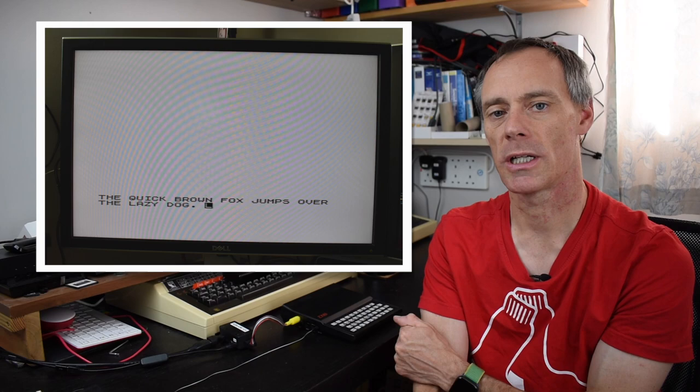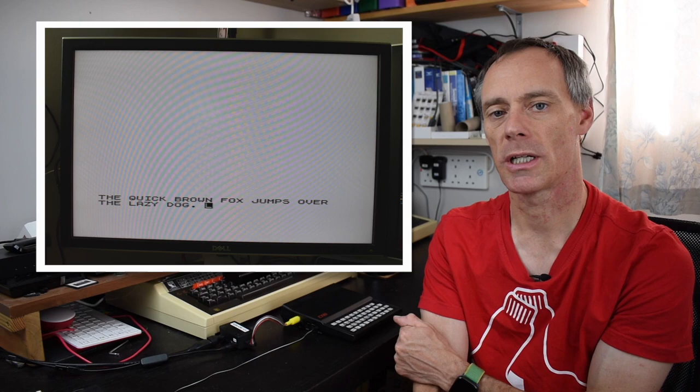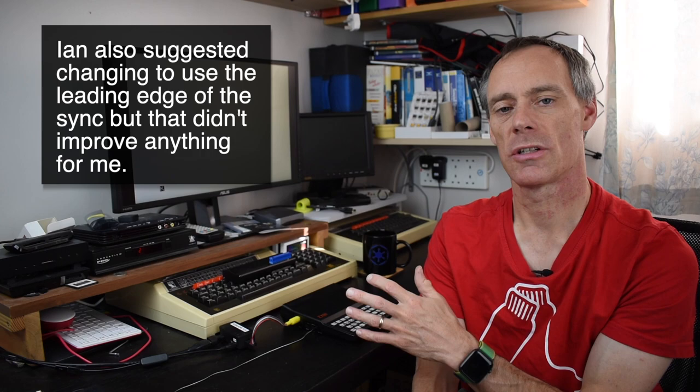I think I'll stop there. I'm getting a good picture out of the RGB to HDMI — I do have to adjust the settings after it's been on for a little while and the voltage changes, but that's no big deal. I've also tried the composite video output directly into my Dell LCD monitor and that gives a good picture, and also into the video input on my old green-screen Commodore CRT. I've heard there's another modification involving a 220 ohm resistor, but that's for another day. I'm not really sure I've achieved very much — the settings look very similar to before — but when your project is to improve the video display on a ZX81, you're not really doing it because of where you end up but more because of what you learn along the way. My subscriber count's just gone over a thousand, so thank you very much. The next video will likely be something involving the BBC or possibly that Econet interface on the Electron everyone keeps asking about. I hope you found that interesting and maybe even useful — see you next time.